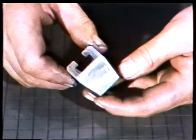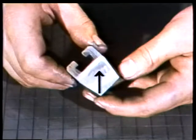You should inspect the disc often. Remove all of the lapping compound and then make several strokes on the block. Inspect the disc closely. Dark spots indicate areas where the disc is not seating squarely.